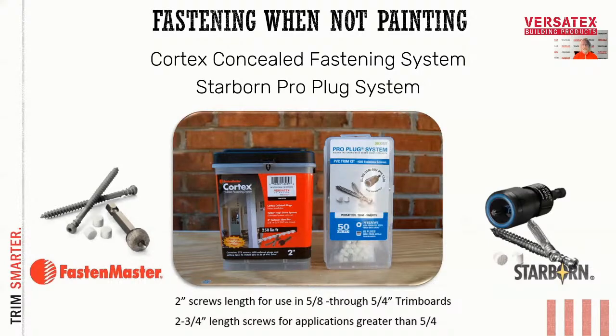Make sure that you're getting the right length, up to 1 inch. You can go with 2-inch screws, and the reason you can do the 2 inches, it's going to countersink a 1/4 inch, so you still get that 1 1/4 inch penetration. If you get into some thicker runs, or you're starting to go through some type of foam or something that's not really considered a substrate, just make sure you're using long enough fasteners.